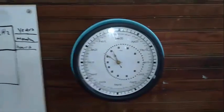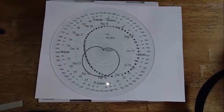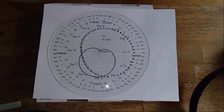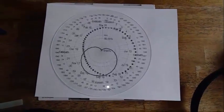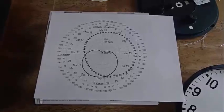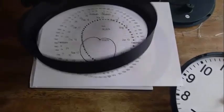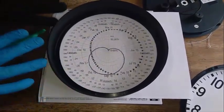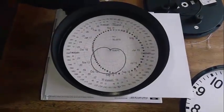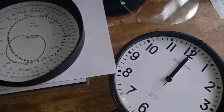Now, as far as spacing goes, one piece of cardboard makes a good washer between the two movements. We should specify that these are two separate movements — the bottom one is a clock movement, still counting hours; the top one is a calendar movement, calculating years. Because they're both run off one battery from the clock movement, we can consider it one celestial calendar. That's going to create spacing issues on the back because you have two movements back there, and you can see how we used the housing of another clock to create the spacing. Basically, this is three clocks put together. In this video, we'll try to do it in two clocks.